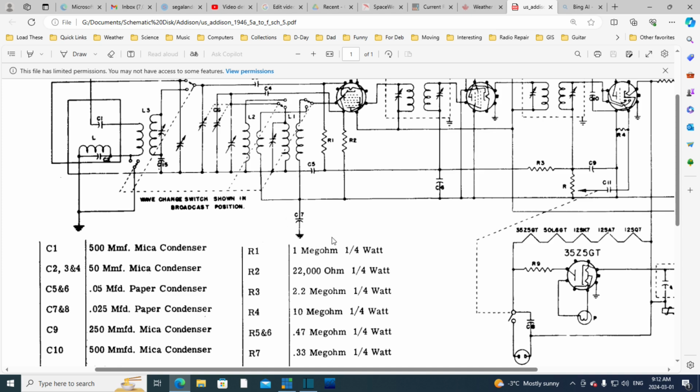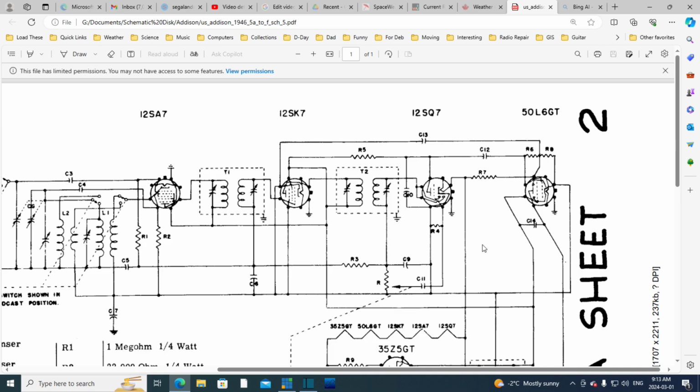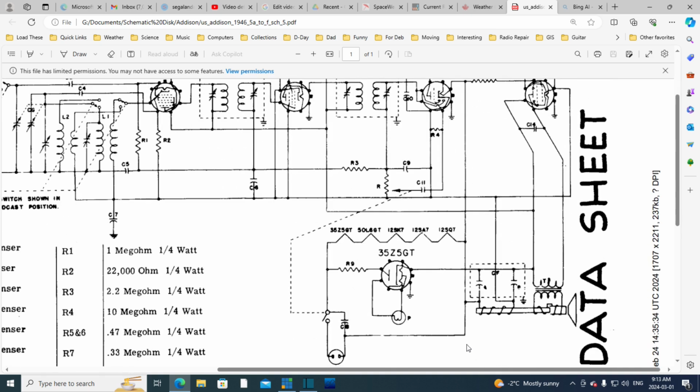So going back to this one, does it connect directly to one of the power wires? Let's just follow this back. Okay, so if you go through the field coil, you can get there. So not quite direct. Okay, good enough. So what that kind of means, let's see, it's 120 volts across the string here. So here we have a direct connection to the power plug.